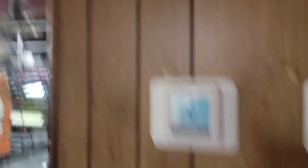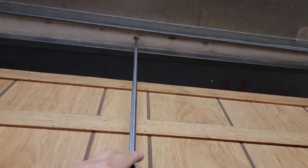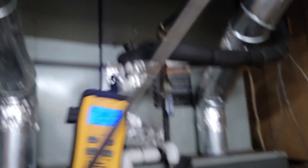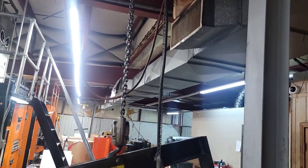Now I'm going to check the temp split. The temperature of the supply air is 52. Found a good spot right there in the flex band to take the temperature. So that's a 20-degree split — pretty awesome. They should stay nice and cool in here now.